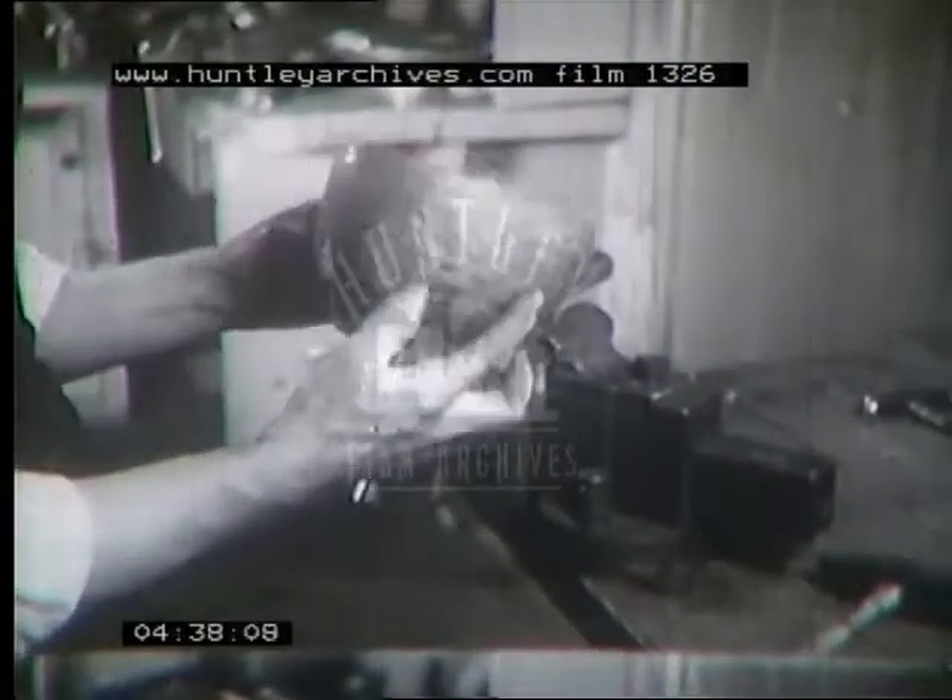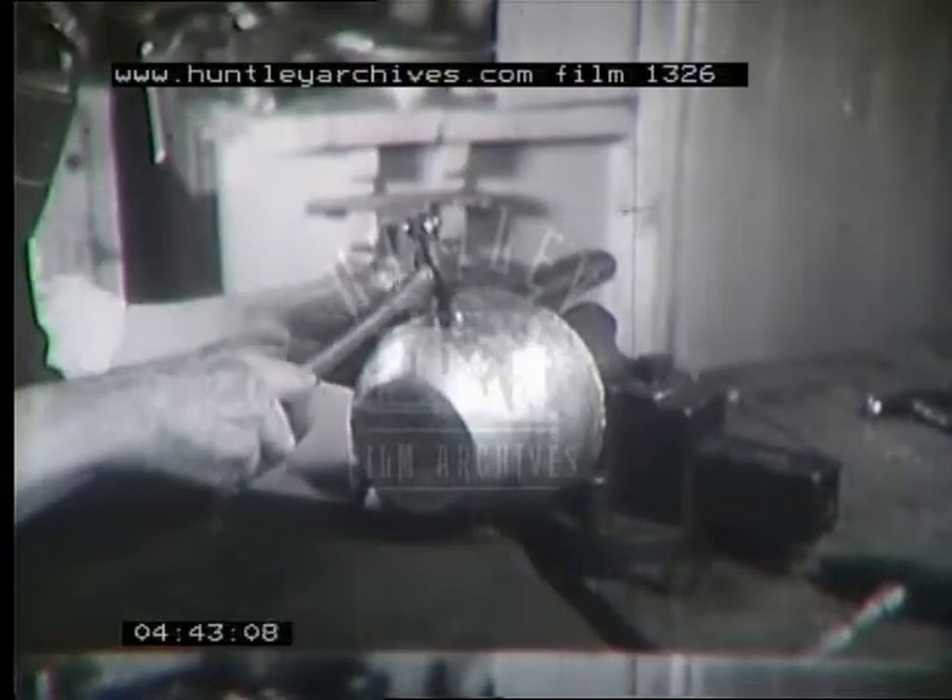This second raising brings it much closer to its final shape. Now we see our bronze bowl as the craftsman completes the final stage of raising. After annealing or softening by heat, the marks of the raising hammer will be erased by a tool called a planishing hammer.